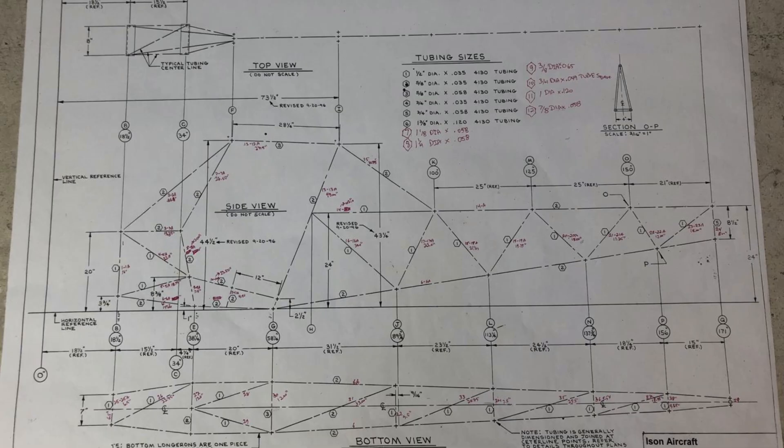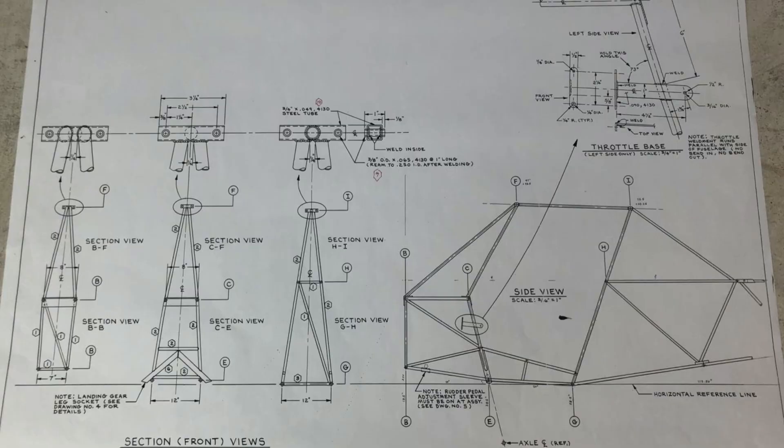Building this fuselage was one of the most challenging things I've ever done — not difficult, but challenging because I didn't want to screw it up, having to cut and grind and start all over in places. Please practice welding. If you've never TIG, MIG, or stick welded, please practice — go online, there are great tutorials for TIG welding. I had done stick and some MIG welding, but hadn't done any TIG welding until I started this project. It's not that hard, but you've got to have a very steady hand and a way to hold the torch so you don't shake. Everything about TIG welding is how smooth you're going to be.